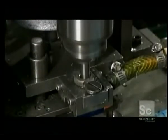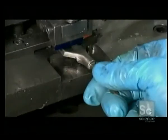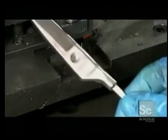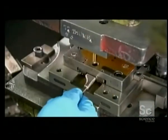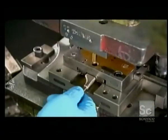To make the hole for the bolt on which the blades pivot, they drill a round hole part way through, then pierce a rectangular hole through the rest. You'll see why later on.